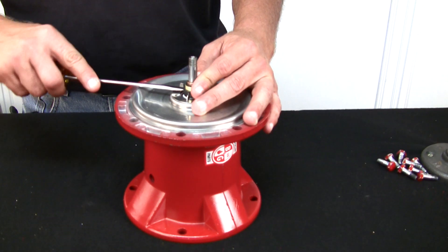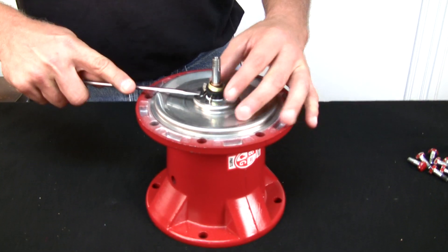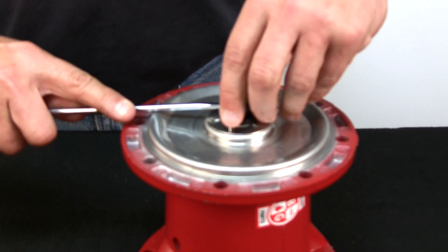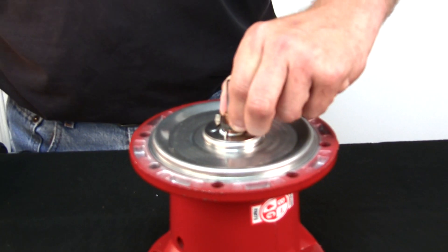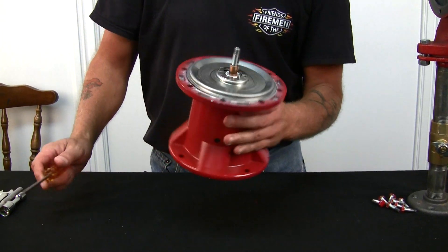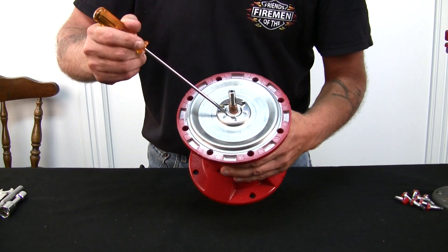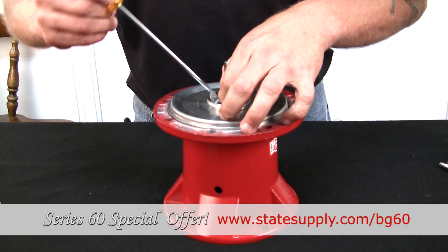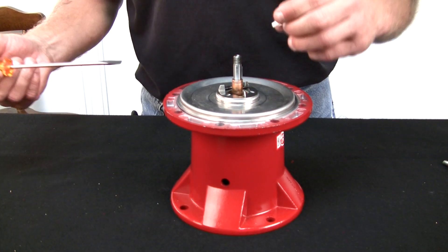I'm cheating because I get to use a brand new bearing assembly. Just pry it right off the shaft sleeve — you can throw all these parts away. Sometimes you can tip over the bearing assembly and knock the ceramic seal part out. Sometimes it'll stay where it is. Just use a little screwdriver, pry gently, and off the shaft it comes.